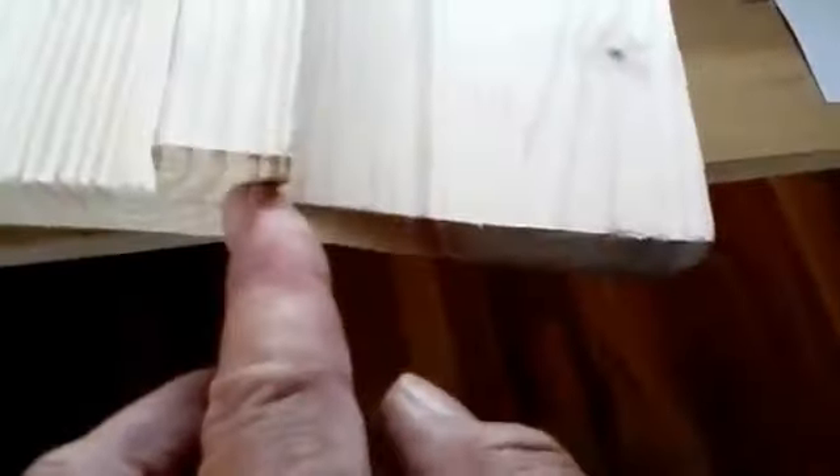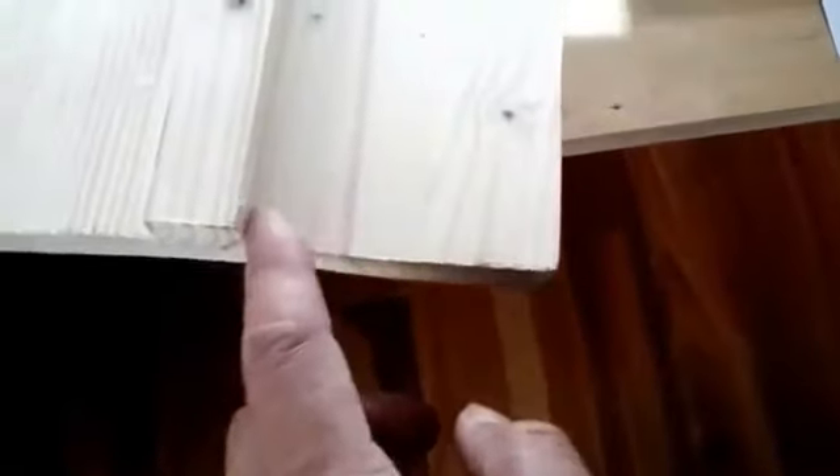This little bar I have in here - I just took a piece and cut off about an inch so it's an inch wide, running along the length. The spacing from this side to this side is three and one-quarter inches, and all the way to the end is four and one-quarter inches. This bar is designed to brace the backrest so it won't be vertical at 90 degrees. I positioned the board at various angles, found what felt comfortable, and marked it to determine where this bar goes.